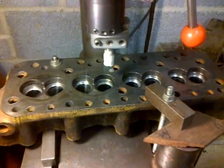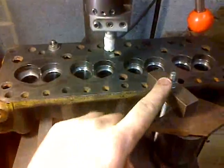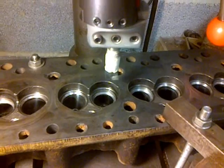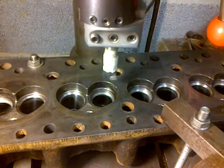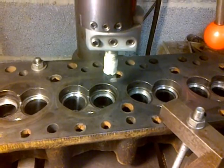Over at the pillar drill, I've got the head bolted down to the table. Underneath there's actually a pin which I've clocked into the table so it's on centre line — it's in the valve guide — and what that does is centre up so I can move the head along and centre up on the new guides and quickly locate the centre, machine the recess properly to the correct size.